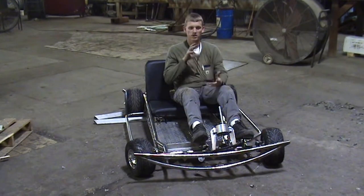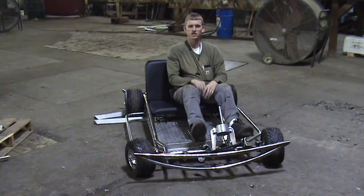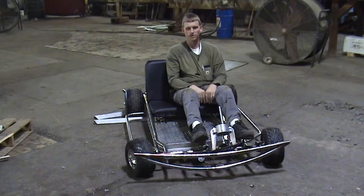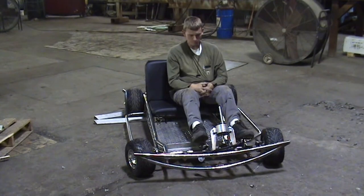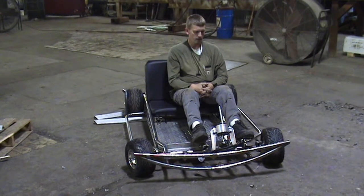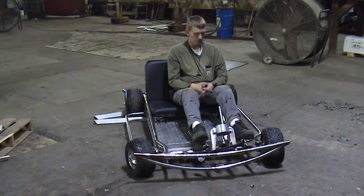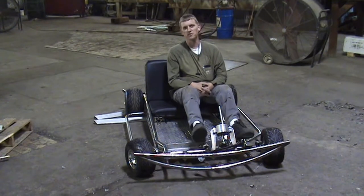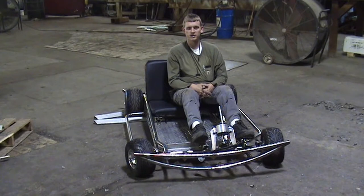You can see how I make it. I have to do a brass bearing and an aluminum housing and solder it together to create kind of an encased bearing. So that'll be interesting, and way overkill for what I need. But that's what this whole thing is about. So let's get this steering column made, and get on with it.